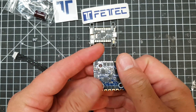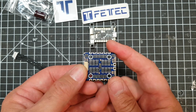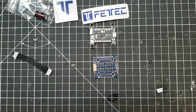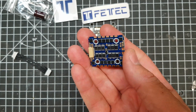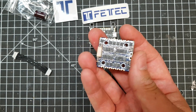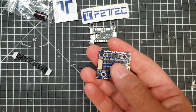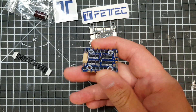There have already been a few updates to the firmware since I received it. Flight 1 had some issues which could cause damage with this ESC, but they've been fixed. Because it's current limited to 35 amps as KISS hardware usually is, what they've done in the latest firmware update is make it so the ESC isn't stopping your power bang on 35 amps - it's allowing you to briefly burst over it like you would in normal flight. All these MOSFETs are rated for 40 volts so it should be sufficient for the majority of quads.